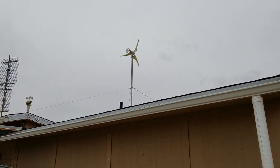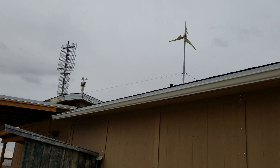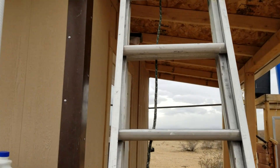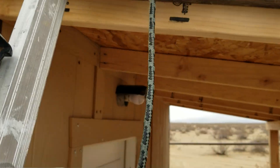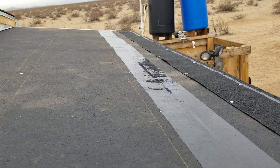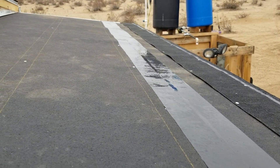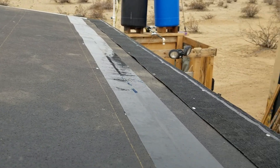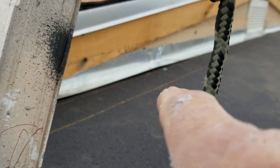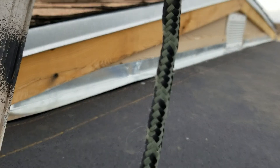The wind just recently picked up and I'm glad of that — you can see my turbine blowing and my flag is blowing. I was up on the roof today and I left the ladder here so I can show you what I got done this morning. I got the tar paper on with a seal on the joint so the wind won't lift it. I got my starter roll on and put my upper flashing on — I usually don't put that on until last, but I wanted to make sure I didn't have water going down behind there causing any damage. I'll put another Z-flash over the top when I'm done.